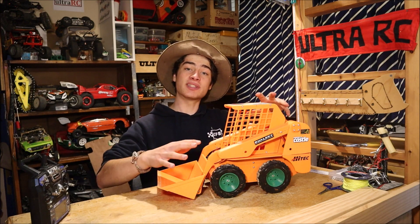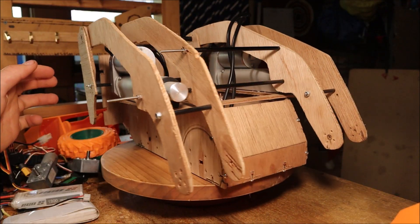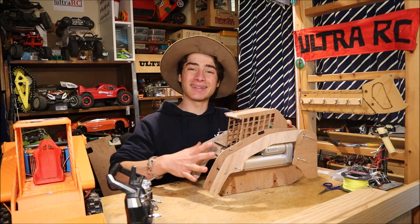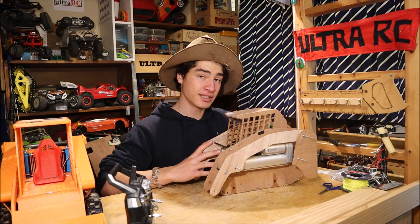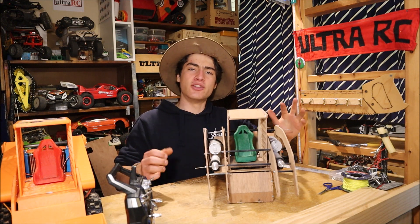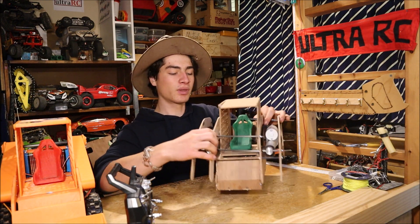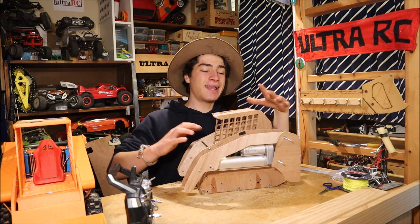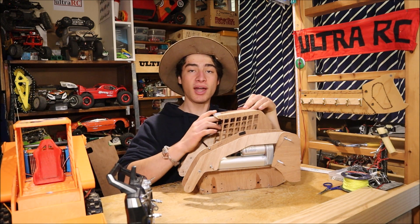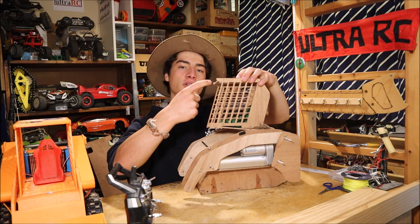I want to show you the previous version, which had been CNC-routed. This is the old version — you can see it's been laser-cut style and it's not as good as the 3D printed version, not least because it's not orange. The main problem is these huge actuators, which make it look way out of proportion — it's just sort of flimsy and not ideal. These actuators can lift a lot but it's just not how I want it to be. I wanted this to be accessible so you guys could build it as well, but most people have 3D printers, not laser cutters. This was actually CNC-routed because it's marine plywood — you can't laser cut marine plywood. A CNC router is just an automated drill bit, and because the drill bit is round you can't get square corners.